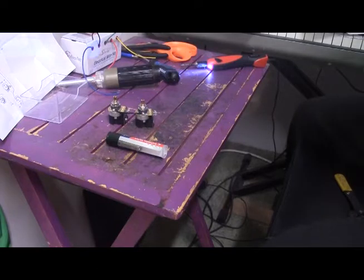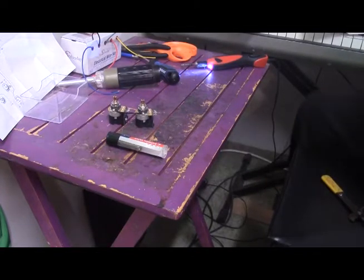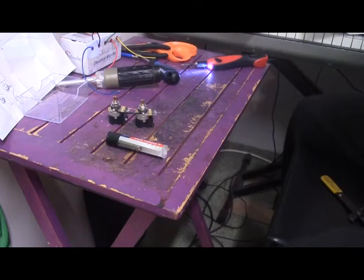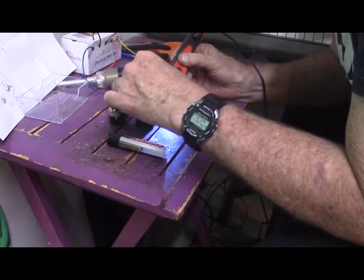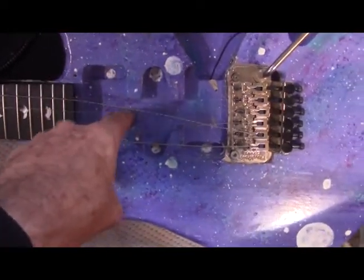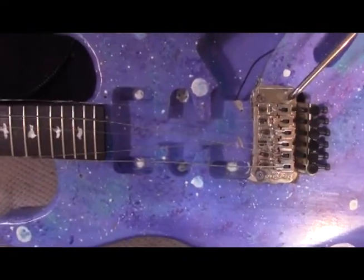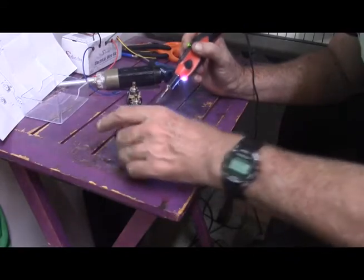on these things. And not just that, but there are some of those things that I really need to take into consideration because of space limitations. For example, when I get ready to actually hook up the pickup wires, I need to be careful because both the middle and the neck pickups have to go underneath the bridge pickup because of the way the cavity is cut. That went in there way farther than I wanted it to.